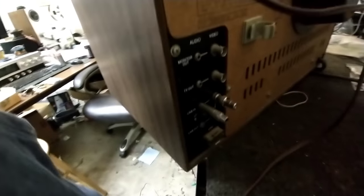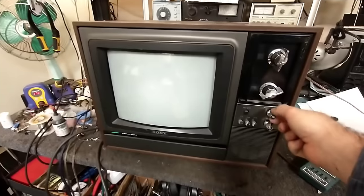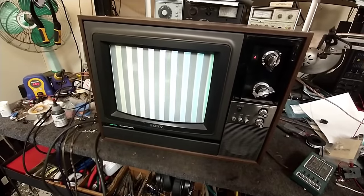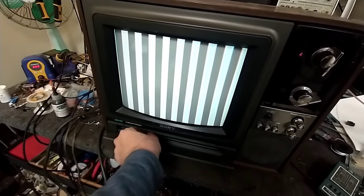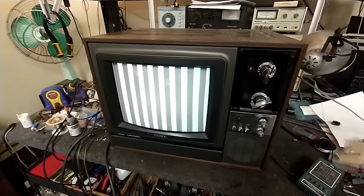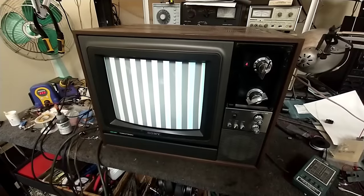If we move to the back here, hard to see, but we have our antenna connections and a pass-through for our audio and video. We have our VTR connections and our line-in connections. The problem with this guy is it's had a failure in the color burst circuit. No matter where you set the color, it's just so faint — that's the color control turned all the way up, and there's barely any noticeable color at all. That happens regardless of whether you're on the tuner or the line-in. So we're going to crack this thing open and see what the cause is.